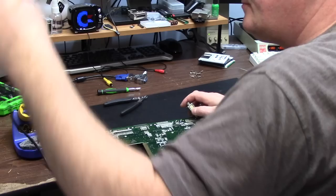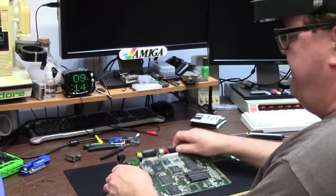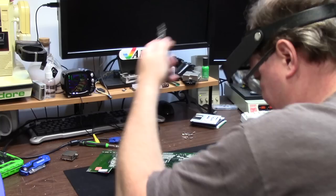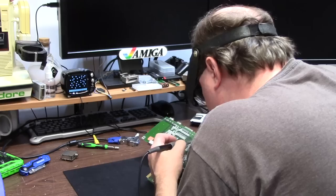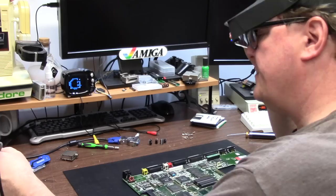Whoop, no, a little bit of acid, leaky cap. For the through hole removals, I trimmed down the legs. Caps come right out nice and easy. No fuss, no muss. Showies. There we go. Four through holes, and I'll clean those up as we go along.